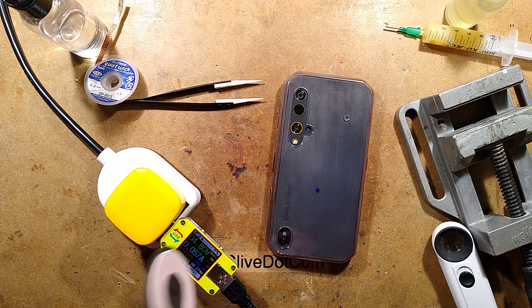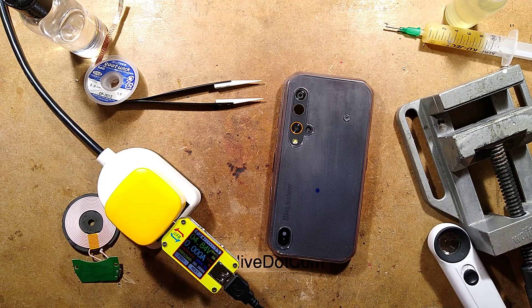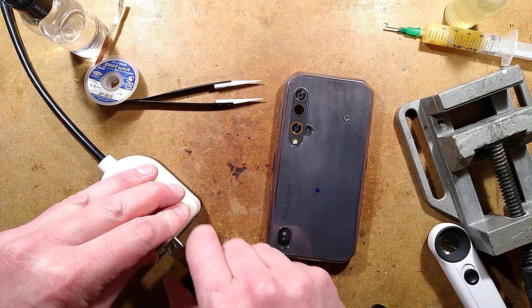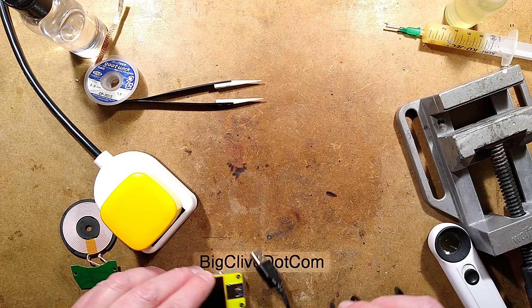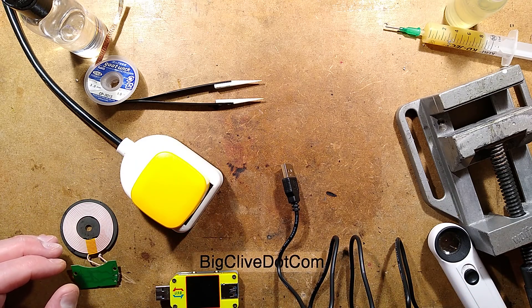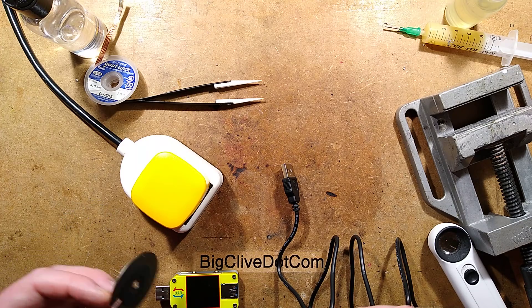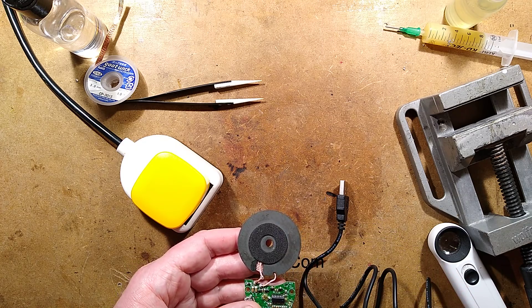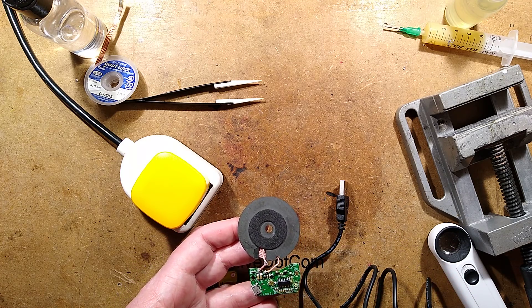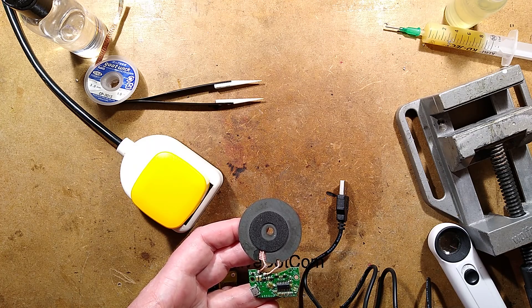That was a success, even if that chip is mysterious. If anyone can identify that 16-pin surface mount chip, it would be interesting to know if it's a standard chip or a microcontroller. The analysis is complete — a fairly typical design with an H-bridge — but quite interesting to ponder whether they've implemented it in a microcontroller instead of a dedicated chip. That would be quite clever.